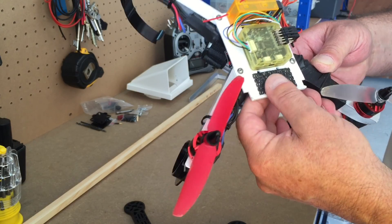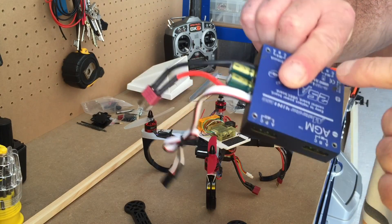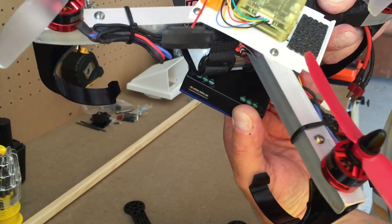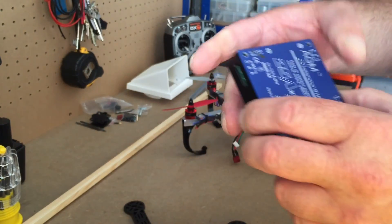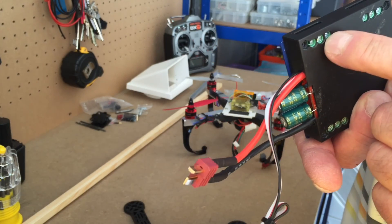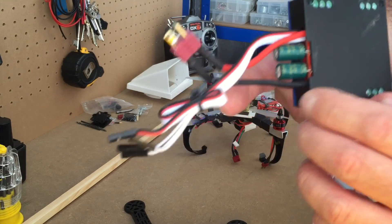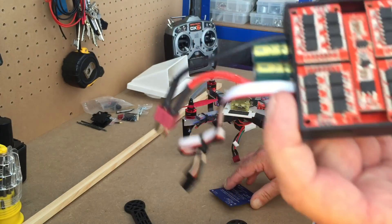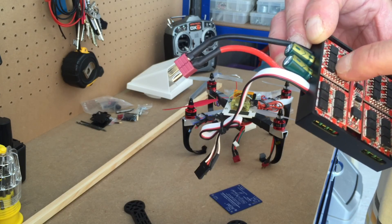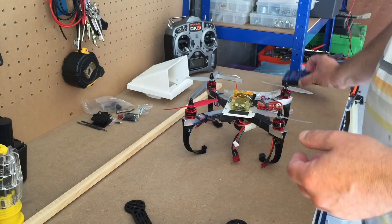I braced it together. The original plan was to use one of these all-in-one ESC boards — I had to drill it out slightly bigger for my screws — and mount it underneath without separate ESCs. I did want a completely clean build, but I somehow broke this one. I was screwing the motor wires in, and I was unsure of how strong they'd be, so I went a little bit over-tight. After that it's only putting out two phases to one of the motors, so I think I've probably loosened a solder joint somewhere in there.